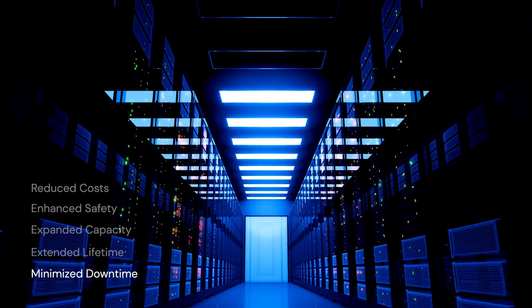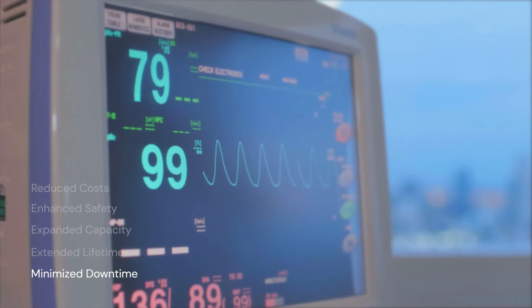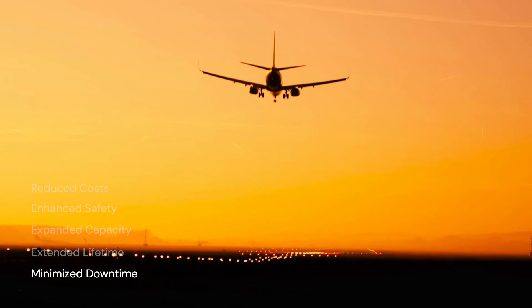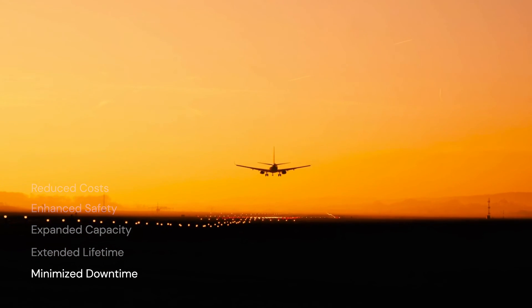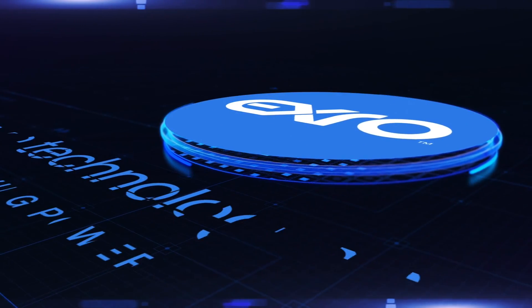Because we're driving each cell individually, there's redundancy. If one cell goes bad, the whole system doesn't go down — you can keep operating. So there's a certain level of uptime security. For mission-critical applications — hospitals, flight applications — if you have an electric plane, you really don't want your battery to stop. Having that redundancy and safety functions that allow the battery pack to keep running if one cell fails is quite significant.